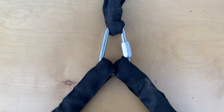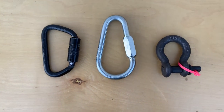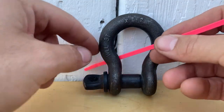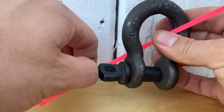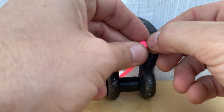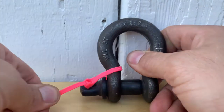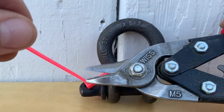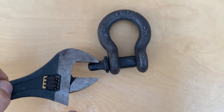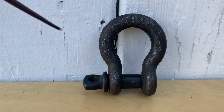But if you say, I'm on site right now and I don't have time to order something from France — another super safe option would be a bell-shaped shackle with a mouse pin. The mouse is a zip tie that's placed through the bell of the shackle and through the eye of the bolt, connecting the bolt to the shackle. Kind of looks like a mouse's tail when you're done. Always a good idea to come back with a pair of snips to clean it up. I like neon zip ties because you can see them from the ground. Tighten with a wrench to make it permanent. This shackle is a half-inch shackle with a working load limit of 3 tons.